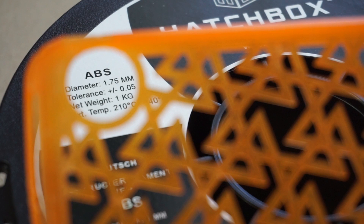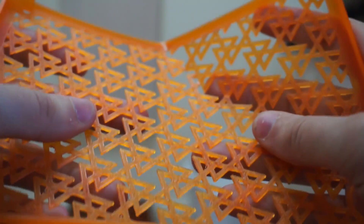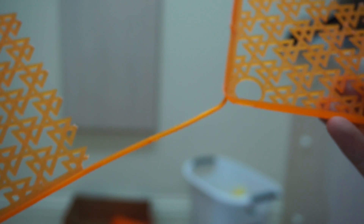Before I conclude this episode, I have a few notes about ABS and PLA plastics. 3D printing large precision parts in ABS can be difficult, since ABS tends to shrink at a higher rate than other materials such as PLA. Printing small precision parts can be difficult with any material because of the printer resolution and the structural limitations of plastic. This case has a little bit of both — large overall dimensions with very thin edges.